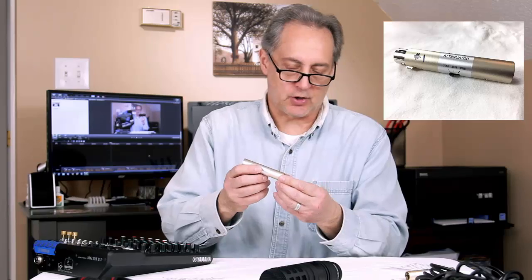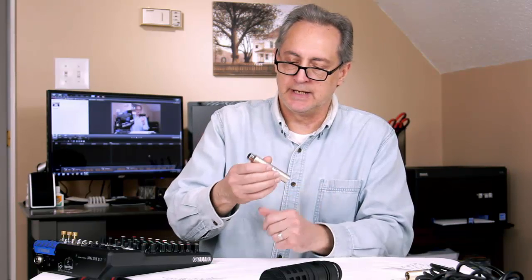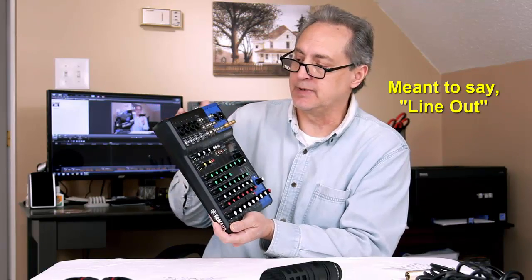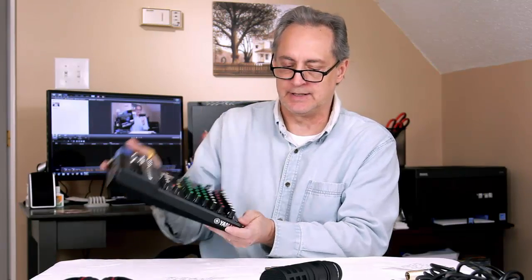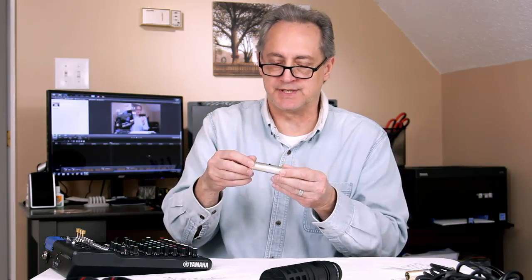Thirdly, we're going to need these — I think they're called HOSA. They're an XLR attenuator with a switch that goes from 20, 30, or 40 dB depending on how much you want to attenuate. The reason you need this is because the line out on this is really hot — almost too hot for a digital SLR camera. Right now I'm using a shotgun microphone plugging right into my camera through the Saramonic Smart Rig at mic level, but what comes out of the Yamaha is line level. So we need this HOSA attenuator to take the volume down a step so it won't get garbled inside the camera.